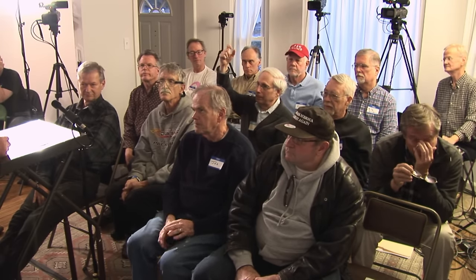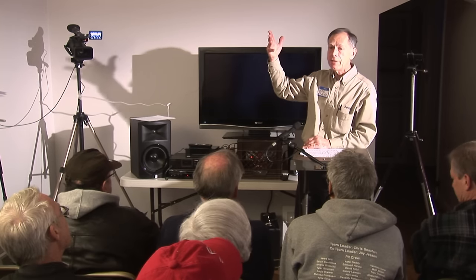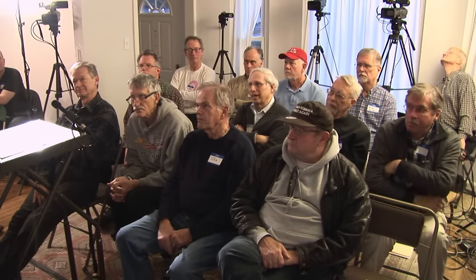There are a lot of other tricks you can do. You can use vertical polarization and take two of these antennas and stack them vertically with a phasing harness — you can get another 6 dB or more of gain and still be omnidirectional, which is nice. But that's more complexity, more space, more height. This single antenna is five feet high; if you want to stack them, you'd need ten feet.